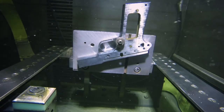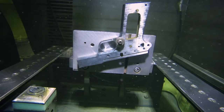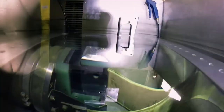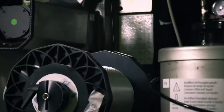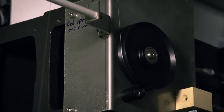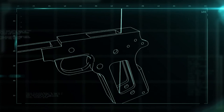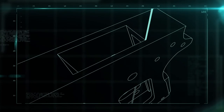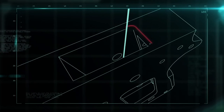The pistol body is again submerged in water, this time to conduct electricity. With both the metal and water electrically charged, intricate detailing is done using an EDM or electric discharging machine. Stainless steel wire is charged with an electric current at 300 volts, then run through the magwell, carving the fine details onto the steel surface by literally burning off metal particles.